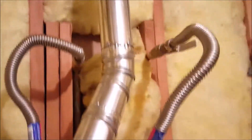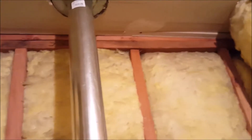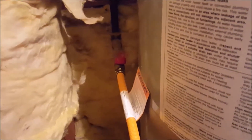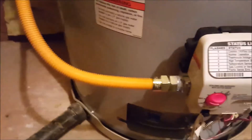Just a couple of offset 45s to get back down, all screwed together. It's heating right now — it's already hot — but it's pretty stable, not moving around anymore. It's going to be exhausting up and out through the roof as opposed to into the room or into the attic. We also replaced this flexible gas supply line. The valve looks good; it's one of the older-style valves — I like to replace those — but this is a newer style so I highly doubt there's a problem with it. We did want to upgrade this supply line to corrugated flexible stainless steel.